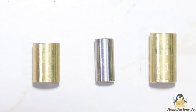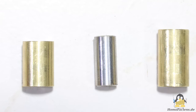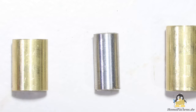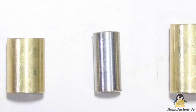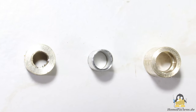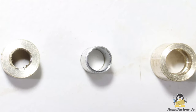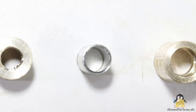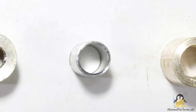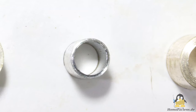For a deeper understanding of the construction principles, and for very brave early adopters, here is a rough description of how I made version 4.1. The core element is the tube and it is composed of 3 parts. The middle part is the heat barrier, consisting of an 11mm long piece of stainless steel tube with 6mm inner and 7mm outer diameter, which corresponds to a wall thickness of 0.5mm. This tube is sufficiently sturdy and thin-walled enough to allow as little heat as possible to pass from the hot to the cold end.